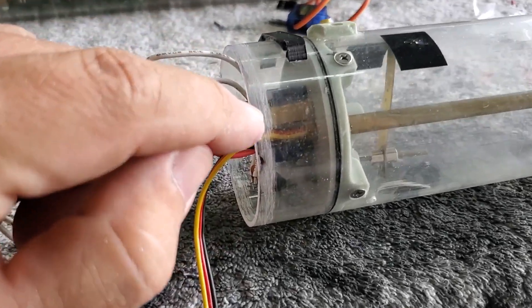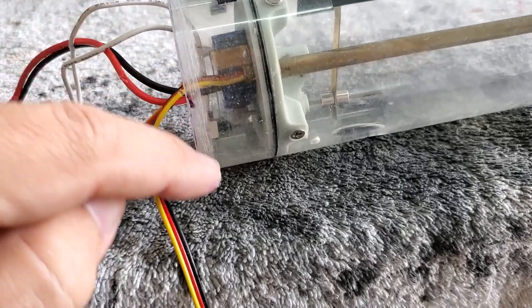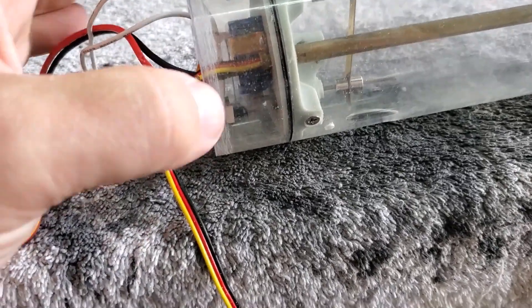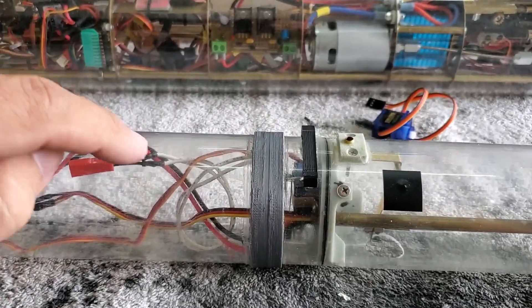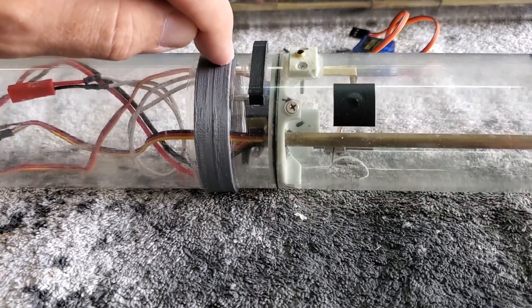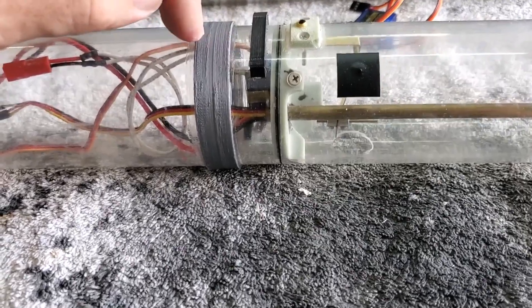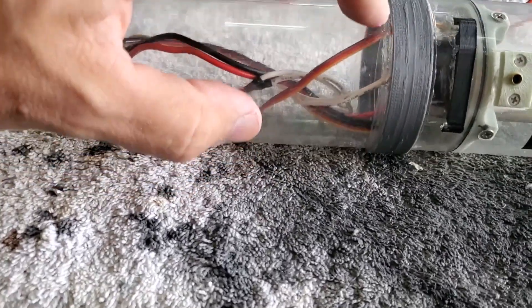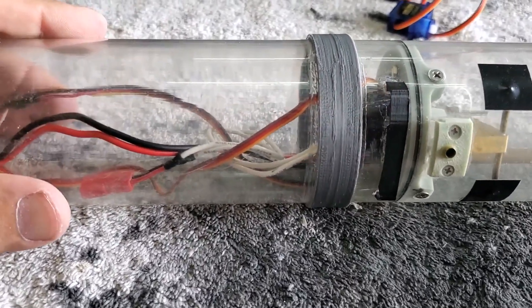Here you can see I've roughed up the edge and cleaned up the ring. I'm going to put a nice thick bead of epoxy around the outside, press the ring on, and let that cure, then do the same for the other side. On the completed repair, I also applied a bead of epoxy around the face to make sure the epoxy saturated the entire joint — so on both sides we've got an epoxy bead that will totally seal this chamber off from water ingress.